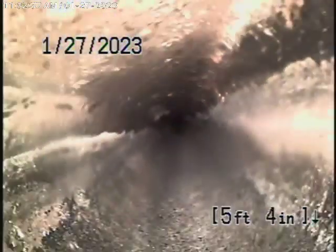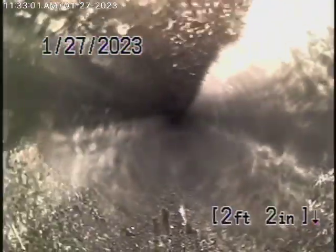There's a piece of ABS plastic over here. This obviously has been replaced because probably the pipe was so bad they had to replace it. This is in good condition. But as you can see, the cast iron pipe is pretty much at the end of its life — it's really in poor condition.